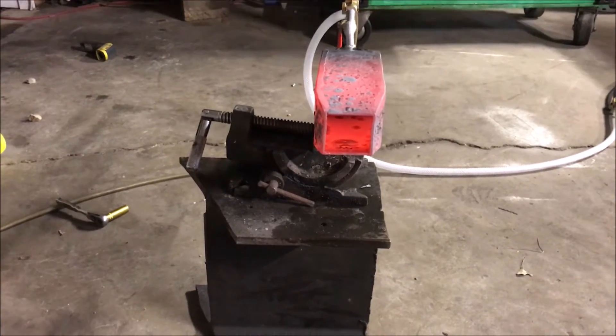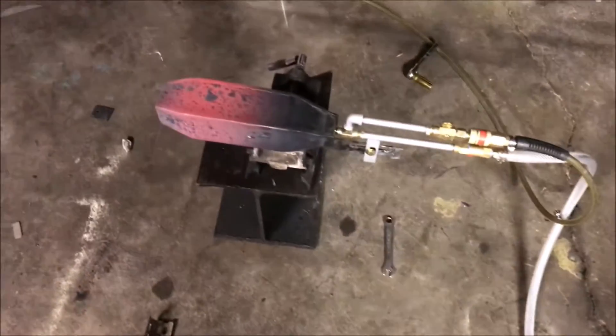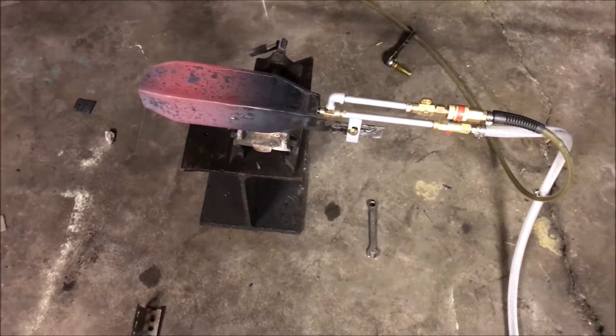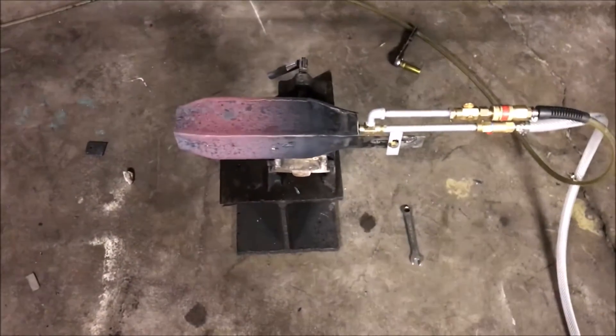This thing will definitely give you some serious high turbulence in the kiln, which would eliminate any stratification. This thing ain't no joke. Forgot to get a pressure reading — I'm almost positive it's 75 PSIs at approximately 11 cubic feet per minute. Substantial amount of air.